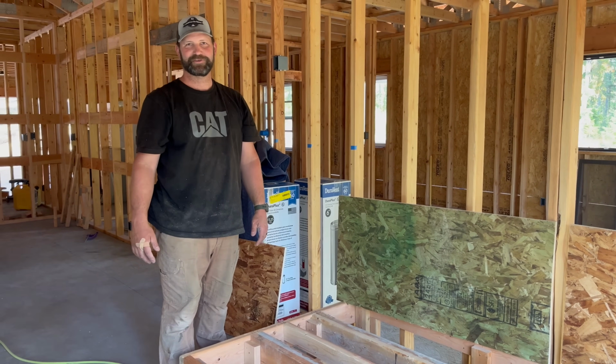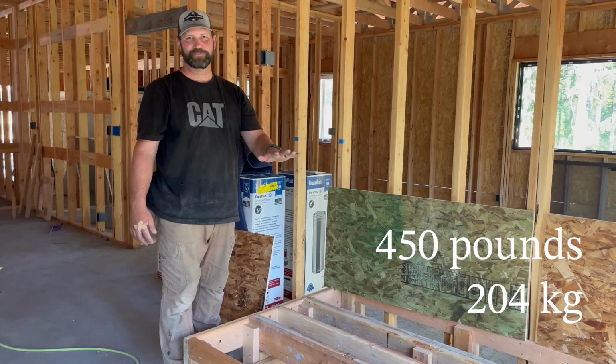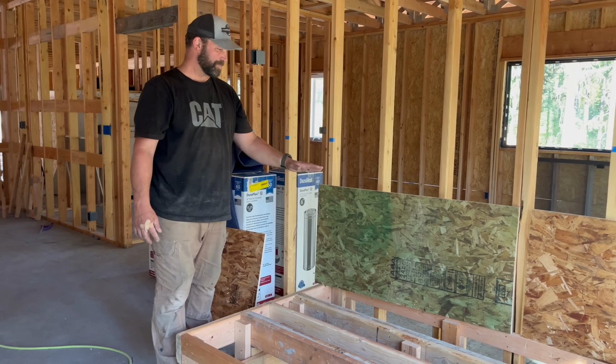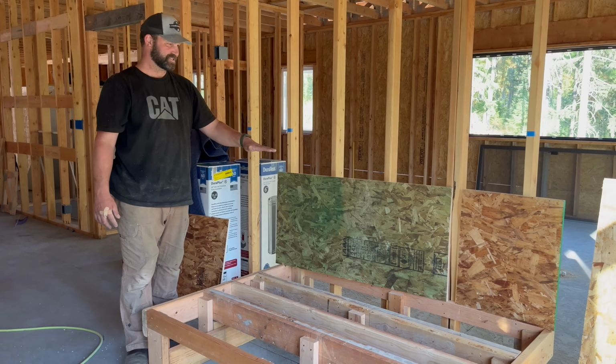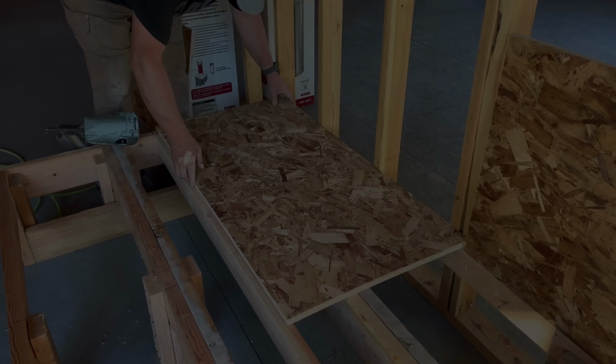No, 600 pounds, 300 pounds. The wood stove is very heavy. So we're gonna have a nice good base so that we don't break the brick that we're gonna put onto the hearth. And then on top of that, we're gonna lay 3/4 inch subfloor, and then we'll do cement board on top of that, and then our brick.